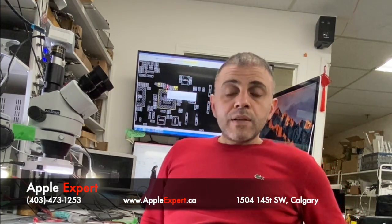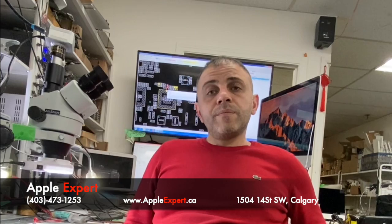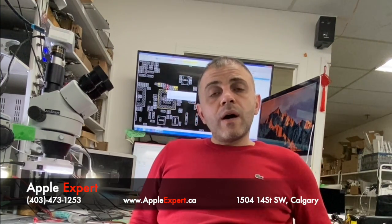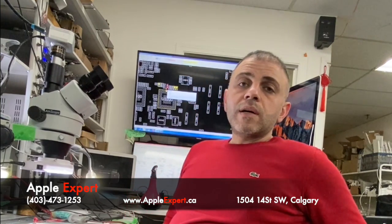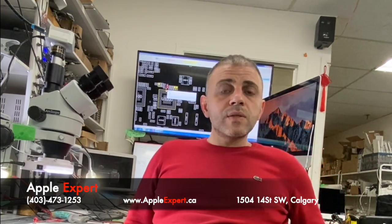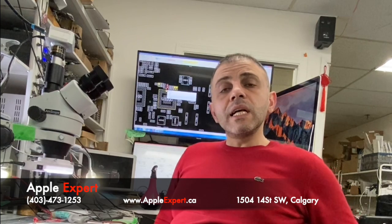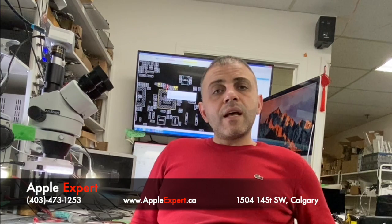We connected to the charger, and I had only 5 volt, with 0.15 amp and 0.37 amp. So I knew there was something wrong. I measured PP3G3 hot. It was 2.8, 2.7. So I know my E7000 works. So I'm left with the USB-C controller. I removed the USB-C controller. I checked the lifted pad, and it was the clock signal, but it was connected to nowhere. So it was just a test point.